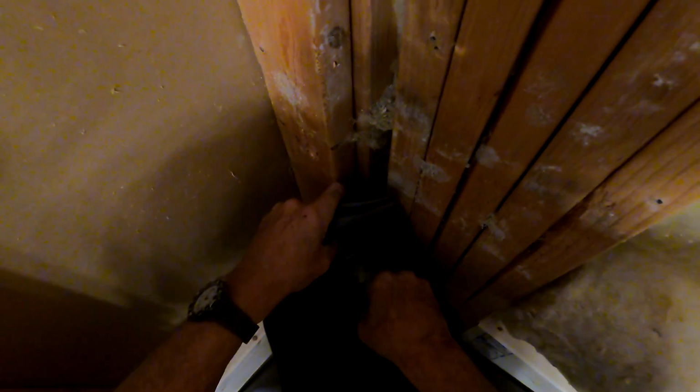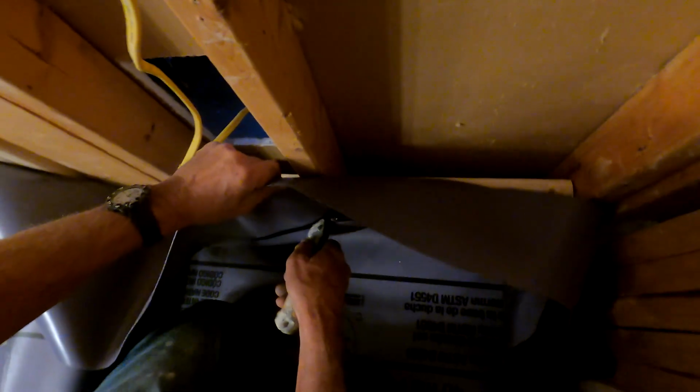There's a lot of liner here too. This is a 4-foot width, by the way, and it barely wraps over the curb, which is fine for me. I don't really care about wrapping on the outside of the curb. I used to, but then I realized it doesn't really matter, because the outside of the curb should never ever see any water anyway.